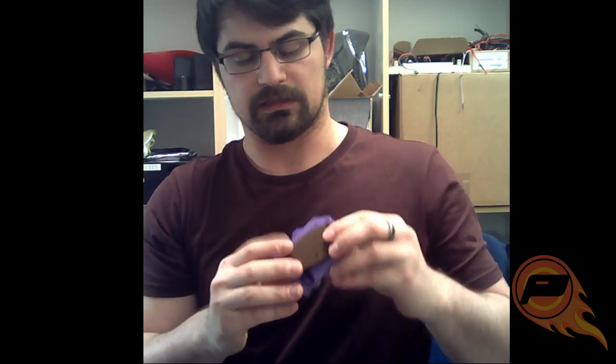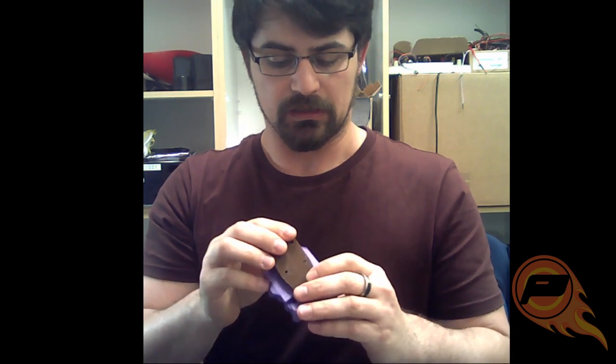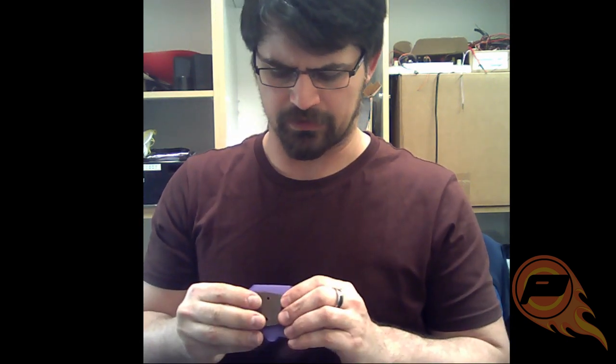DJM, yes, that's correct. So the larger the piezo is, the higher the voltage output, and therefore the more sensitive it'll be. So you have to take that into account when you're building your mounts for it. If you have a mount like I built with this thing, it doesn't need a lot of actuation force in order to make it do its thing. If you have something that has less movement to it, or if you're mounting it in a particular area that might be cramped, all you'd need to do is we'd probably change the profile to have a higher amplification ratio. There's a lot of ways to handle this.